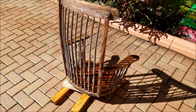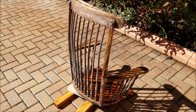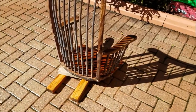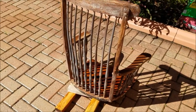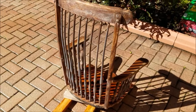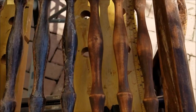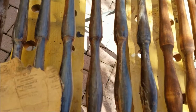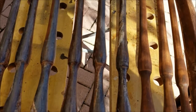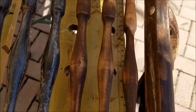After giving it another treatment with the Goof Off — which is very caustic, so make sure you wear hand and eye protection — I rinsed off the whole chair with the garden hose. I don't want to be breathing that in or getting it on my skin when I go to sand it. Here you can see the difference: these three spindles have been sanded and these haven't yet. Using 60-grit sandpaper and going over it lightly cleans things up pretty nicely.